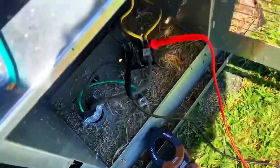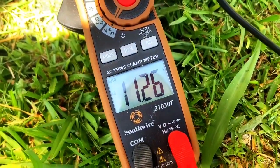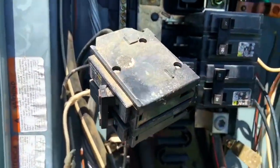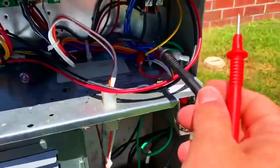11.9 — interesting, that is the right breaker. To ground from this yellow leg here: 11.25 volts. Let me check it back at the breaker — breaker might be bad. So I took the breaker off and measured from the terminals to ground — there's 11 volts, so it's an issue coming back to the circuit, not the breaker.